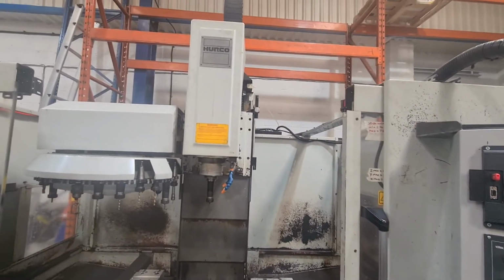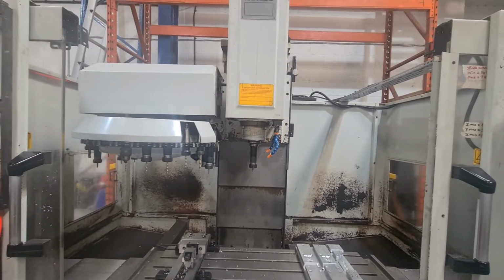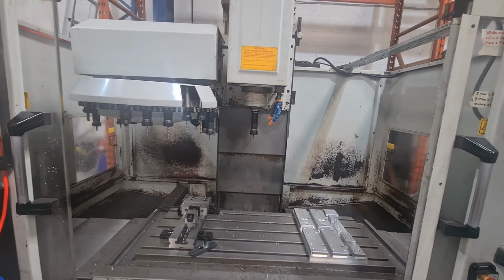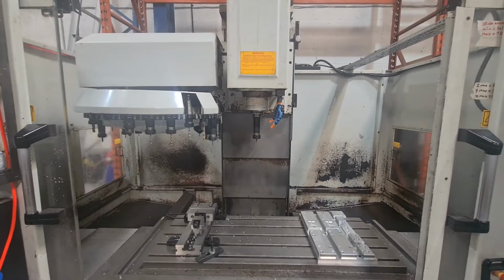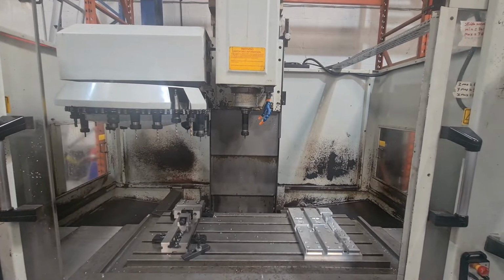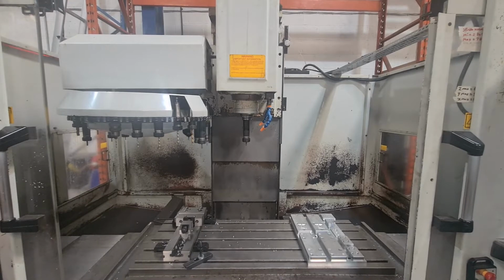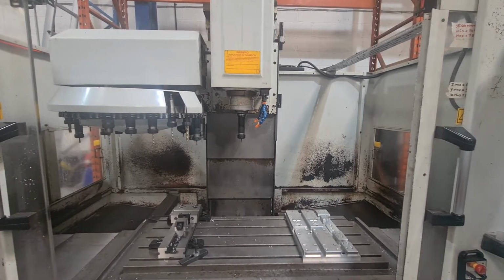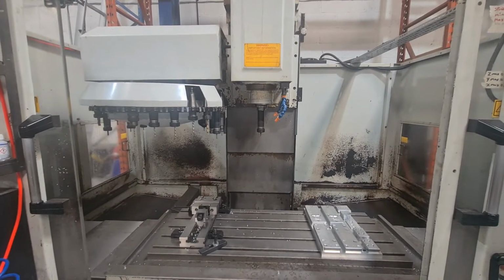I haven't put the spindle motor on it. It didn't need it. This has got a Yaskawa servo drive for the motor, servo spindle, so I've reused all that. It had Yaskawa servos and drives on it. The Z-axis one had got issues, so I decided to replace them. Yaskawa are high quality, but they were very old technology really, and very expensive to buy even today. If you can find them, they want a lot of money for them. So I pulled them off and used the same system as I've got on that Fadal, although the bigger motors, the 2.2 kilowatt motors, and the bigger size, the 180mm size, compared to the Fadal, which is, I think, about 100mm or something like that, I don't know. 110mm actually, so these are like 180mm.